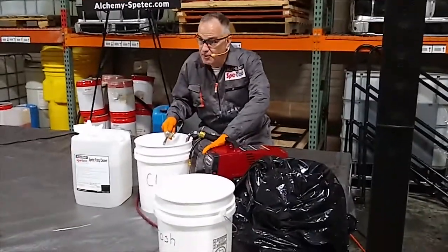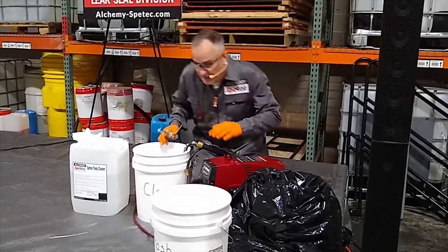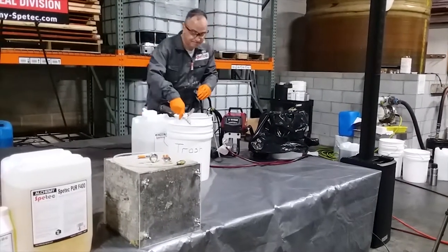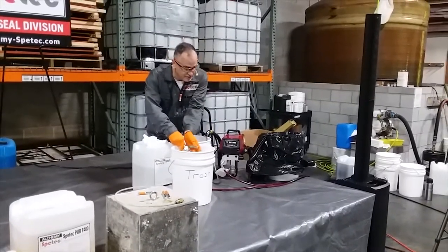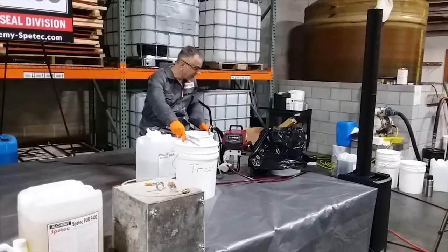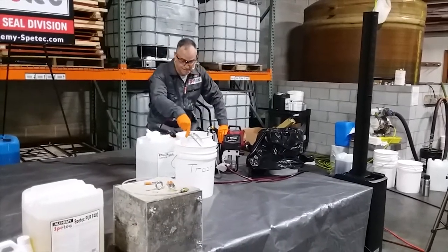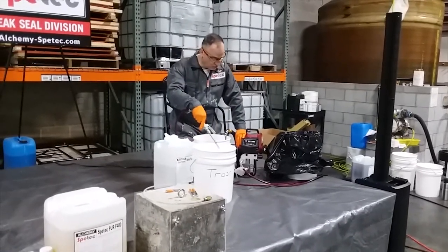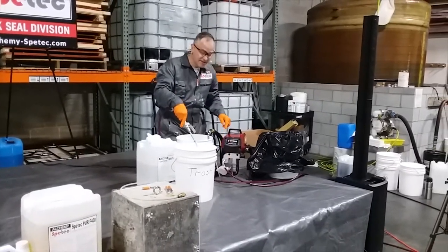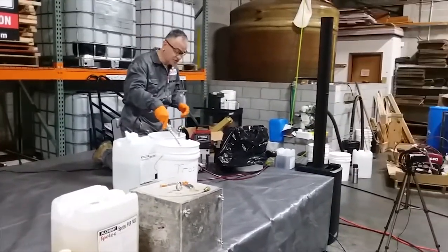For safety, I always dial the pump all the way down. I open up, point at the side of the bucket, and shoot into the trash bucket since we currently have oil in there. I turn it on — nothing happens — that's what we want. I dial the pump up for full control. The hose starts to jump — that means I'm priming. So I've primed my pump without using the prime line.